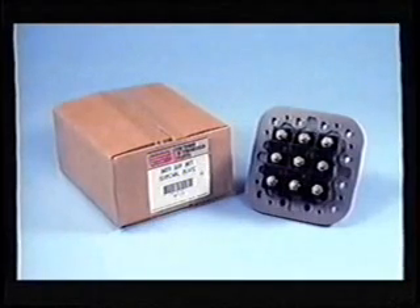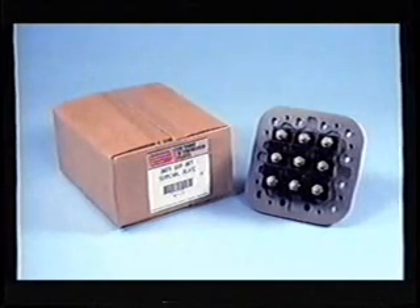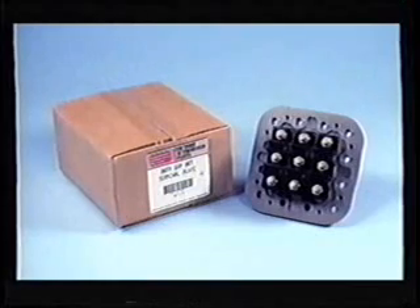Another reason to replace the complete plate assembly is if any terminal is shorted to the terminal plate — use a new gasket. For our example, an 06E compressor has been chosen. A nine-post terminal kit for 06E will be used here. Both 06D and 06E repair kits are available. Note: the 06D compressor requires special tools and techniques, and terminal plate replacements are not commonly done in the field. When working on or around a terminal plate, appropriate caution and safety measures should be followed to prevent personal injury.